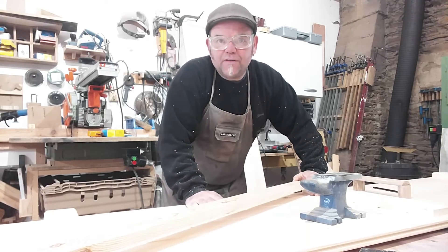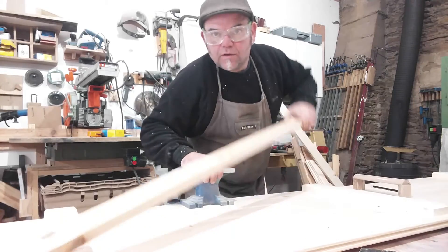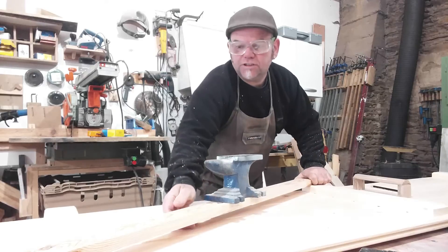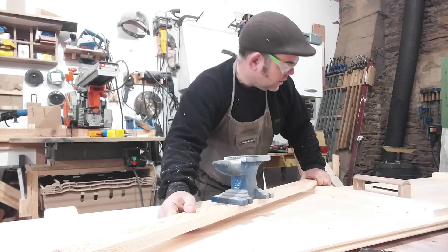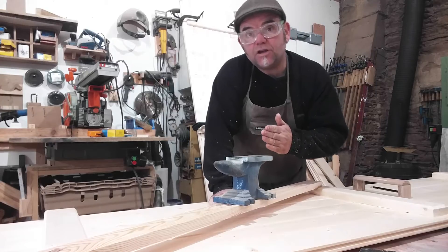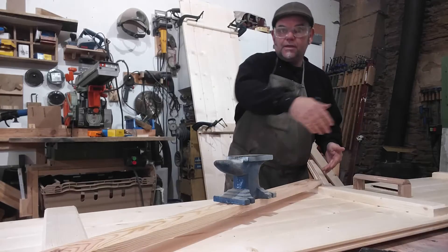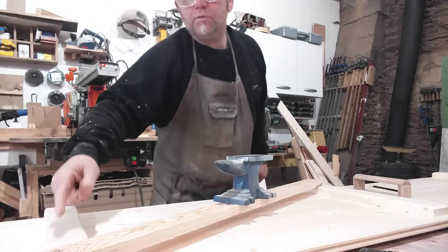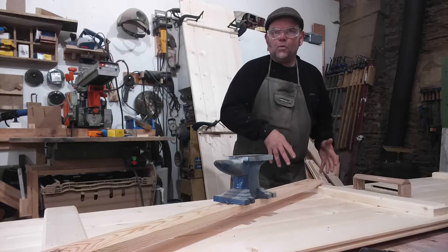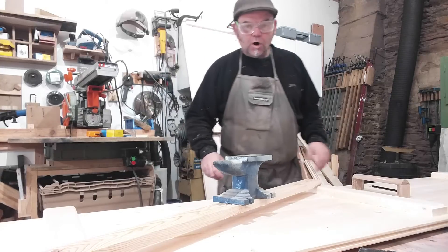I use a little technique — I have a weight to hold this piece, which is going to be my brace. It's a 60mm brace in this case on the window shutter. I'll line up the brace at the right angle — it has to point down towards the hung side. The idea is the load will transfer to the bottom, to the side taking the weight, which is the hung side.